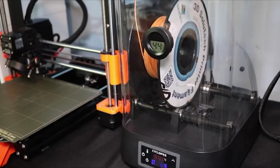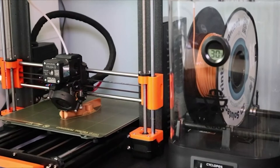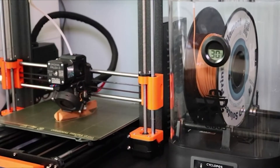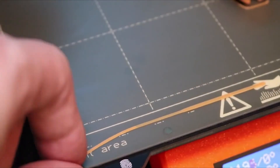For my initial test, I'm using an old spool of Solutech that I've had for a long time. This spool isn't very reliable and I don't use it much anymore, but I put it through a four-hour drying cycle before running a print, and that brought the humidity in the container from about 44% down to 30%.